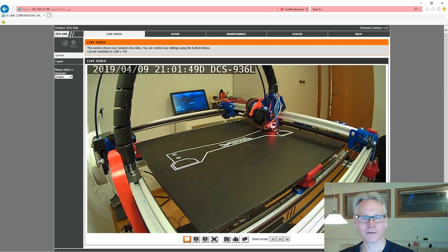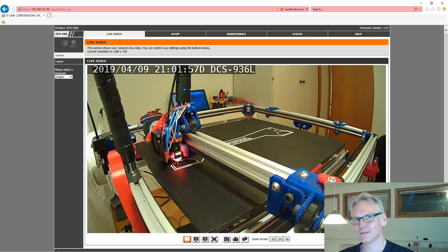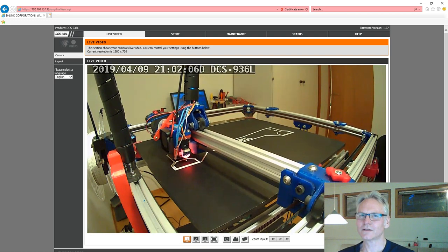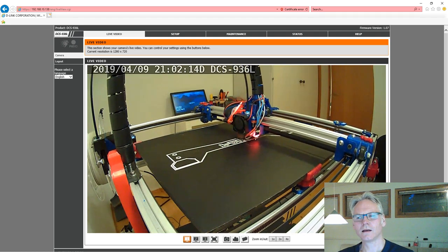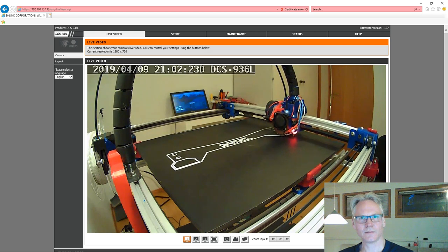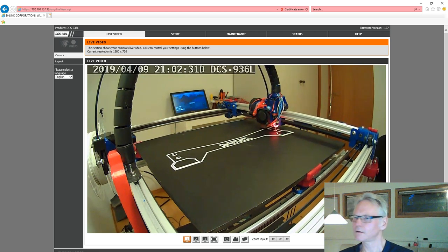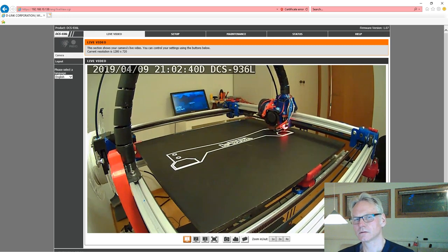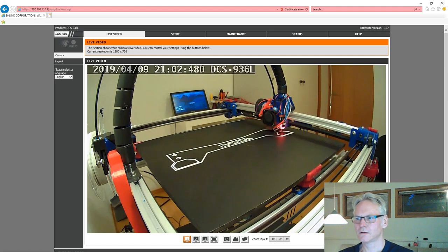You have aluminum rods - sure, hey, they work fine on smaller printers. But the thing is that when rods are mounted horizontally and you start reaching 400mm or above, they will start to sag - they're not meant to be horizontal. So that's why you want V-slots or linear guides. The Hypercube works fine with rods - just don't stretch the build volume too much. Stay below 300mm and you're fine; go to 400 and I don't know.